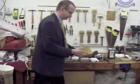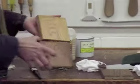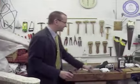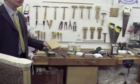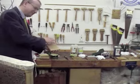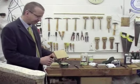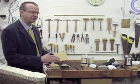You can see the different colours — that's shellac and button polish on bare wood, and that's what we put onto stained wood. One thing you can't do: if you've just waxed a piece of wood and you think you should have put shellac on top instead, you can't just put shellac on top of wax. You have to remove the wax first — either sand it back or use a wax remover liquid.